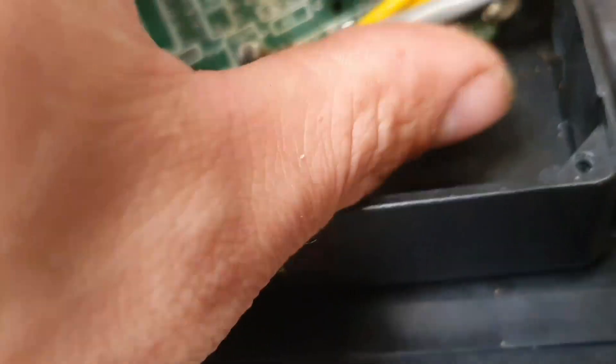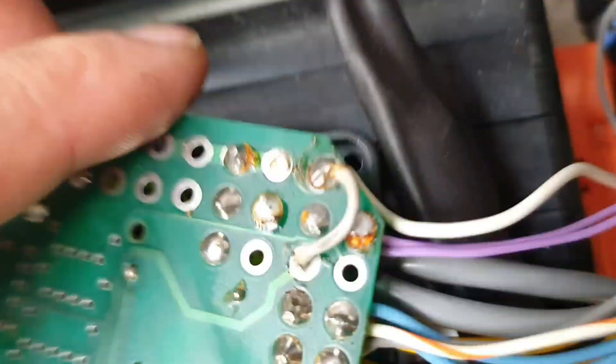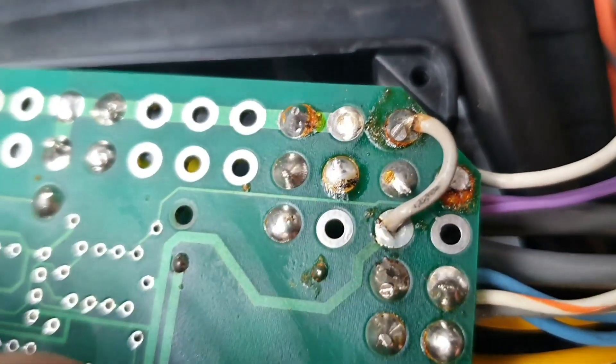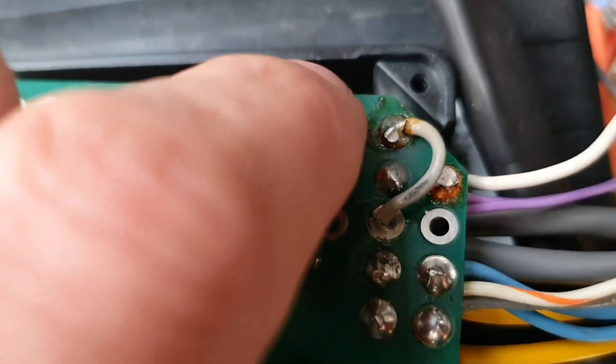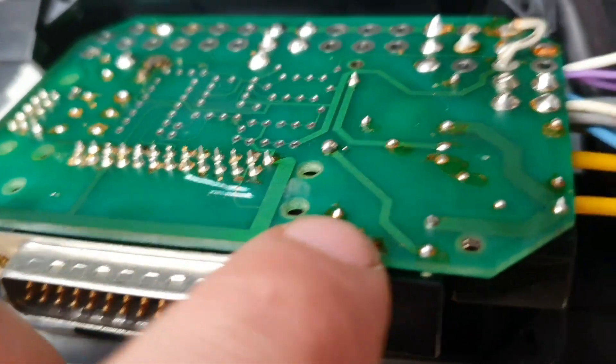Cutting that there, and if we have a look on the other side of the board, it's all hidden under here, but you can see the looped wire just in there. That looped black wire is basically soldered here, and what that's doing is connecting Y — basically star — to the one pin. So this long strip around the edge all goes to one; that's the common.